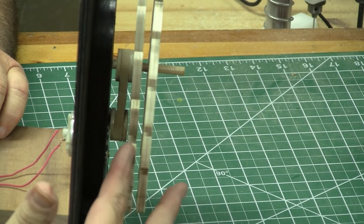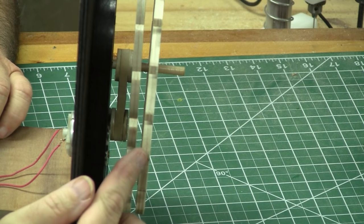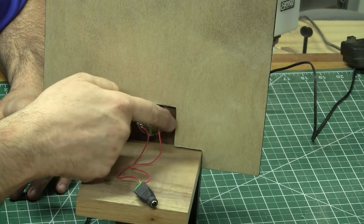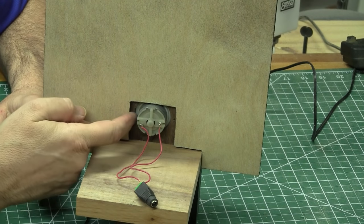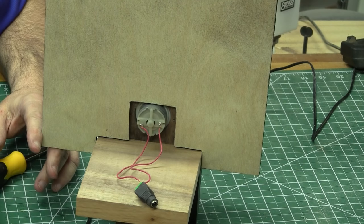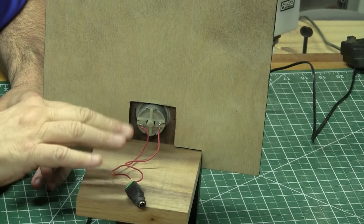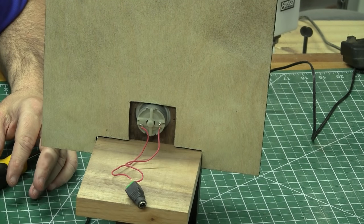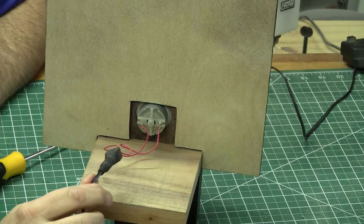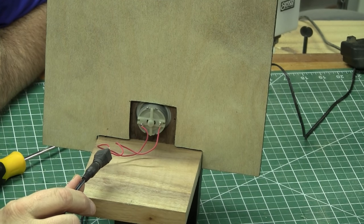I've now installed the outer piece. This is the inner piece — you can see it's free. The outer piece is wedged in there pretty tight so it doesn't turn. The outer piece does not turn; the inner piece does, and you can see it turns off that motor down there at the bottom. Here's the back of the unit — you can see the motor attached and the cutout for the motor to go through. That's fairly easy to install because the motor comes with two screw flanges; you just drill a couple small holes and put some screws in it. I used a little temporary DC plug here to plug the power supply into. The power supply is also available off Amazon — I'm using an 18-volt DC power supply, but it really calls for 12 volts and that should run it fine. I'll have a link to that in the pattern.